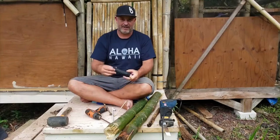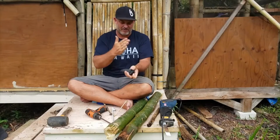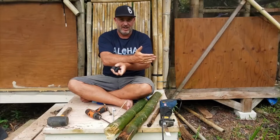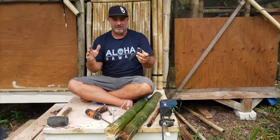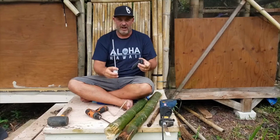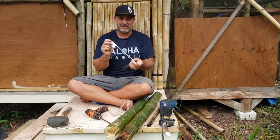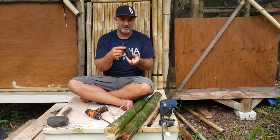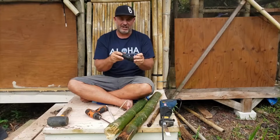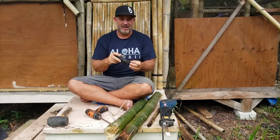And then we have lashing. Lashing is used to join two bamboo pieces together, especially when they're just sitting on top of each other. And this is a great way to join bamboo. It's very strong, but it doesn't last forever. It allows your buildings to move a little, whereas these make a little bit more of a rigid building, but these bolts can tend to split your bamboo and tend to rust out, whereas the lashing tends to just degrade sometimes over age.